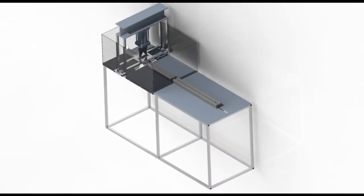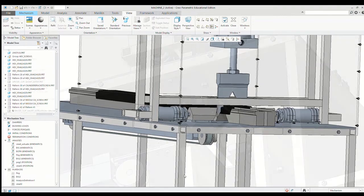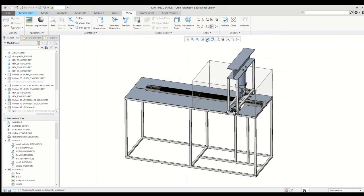This design implemented 3 different punch blades, one coming down from the top to perform a length cut, and 2 on the sides to perform our 45-degree cut. Each of these punches is driven by a pneumatic cylinder triggered by an Arduino microcontroller. The long extrusions are moved towards the punch blades by a peg and belt system driven by a stepper motor controlled by the same Arduino.